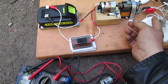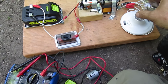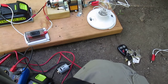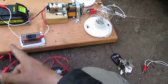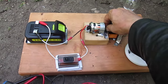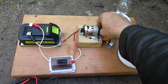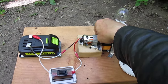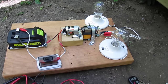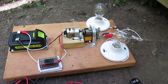The watts on the light bulb, which could have run down a little bit by the time he measured it, was 38 watts. So that's not over unity. We need 105 for 100% efficiency for the entire system. We have losses in the friction here, particularly early on. There's not a lot of friction now, but there's still friction, there's still vibration. That should be accounted for too.